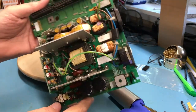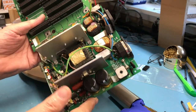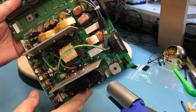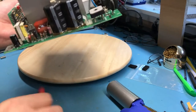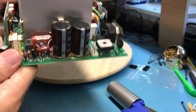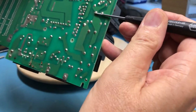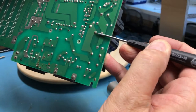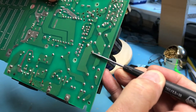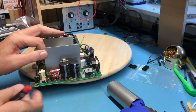The first thing to note is I have no idea how this system ultimately failed — whether it was a power supply failure or a processor card failure. We don't know the failure mode, which immediately means everything on this board is suspect. The next thing to think about are these two large caps. These switching power supplies tend to have large caps that can hold a charge, making them dangerous. That's why I come in here and short across the leads to make sure they're discharged. Caps can build back up charge over time.